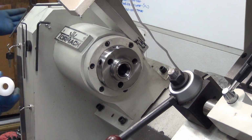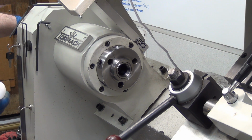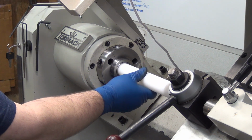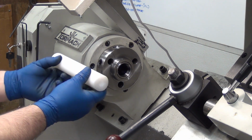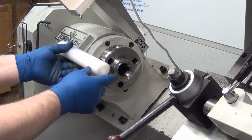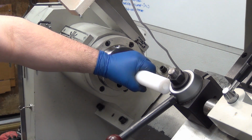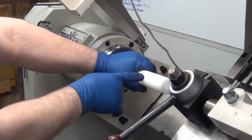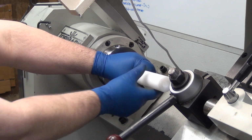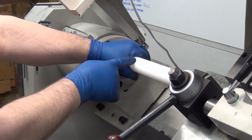I can't come at it from the other side because the parts that are on there aren't that big. Okay, I know this goes down in through the chuck without any problem, but it bottoms out here, and it would be nice to put this all the way in. If I load it up like this and the chuck comes out to here and grabs it, I can make 10 or so washers, but I got a lot of stick out here, and I'm worried about that. Well, then I have to move this out to grab it by 1 inch and then do it again.